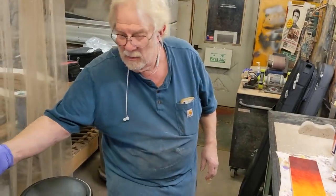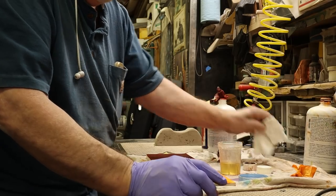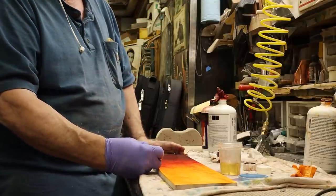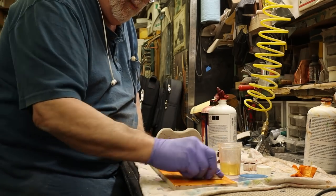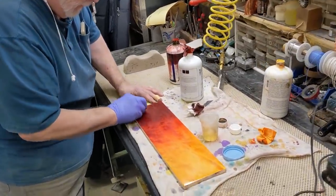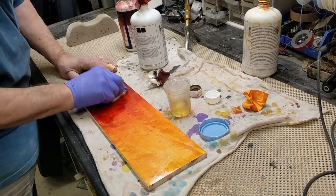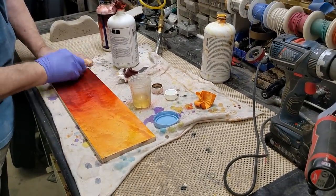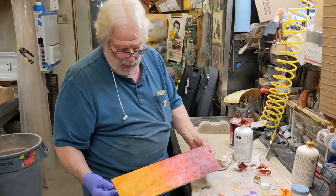You've got to let it dry a second, otherwise it'll run. If you let it dry completely, it's harder to use this to help blend. A lot of times, once it soaks in for a minute while it's still not cured, we'll use this clear penetrating epoxy to seal the color. But it also drags it around a little bit and makes it blend better. We typically don't stain bird's eye though. Anyway, that's the dark cherry sunburst with the sealer on it. That looks great.